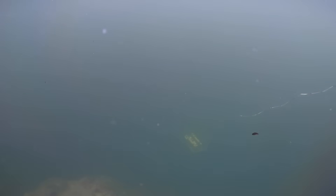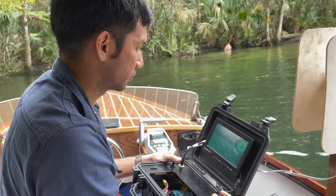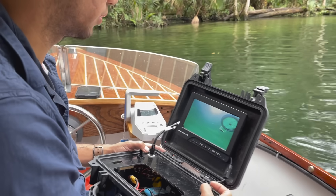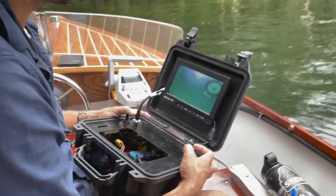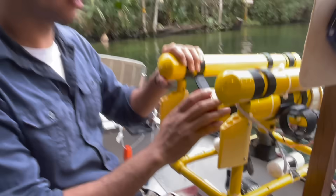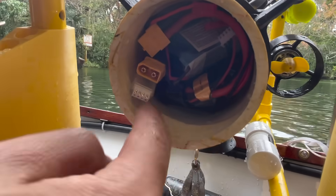Okay, so we're going down right now. It's doing pretty good so far — a little bit deeper. It's kind of fun watching the dial go, because this is just a dive gauge for a diver. We're at 80 feet — cool, I guess it's working. Actually, there's only one slight hiccup: the lift motor is kicking off for some reason, so I guess it's just going to come up on its own, and we'll see what's up with that. Hopefully it's still dry on the inside. Inside here it is completely dry — so 80 feet is no problem. I can just keep adding onto the tether.